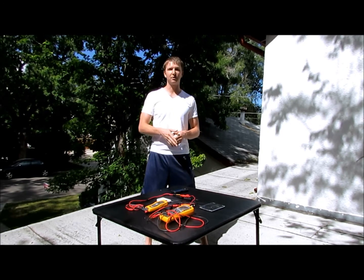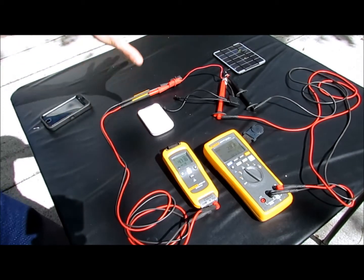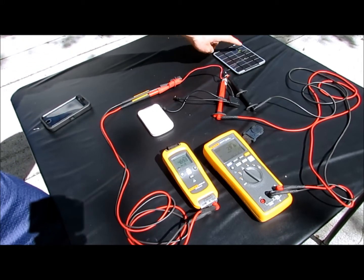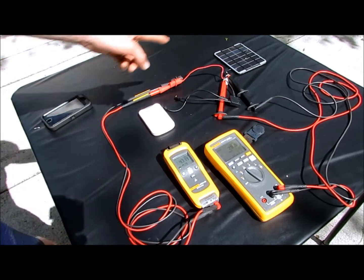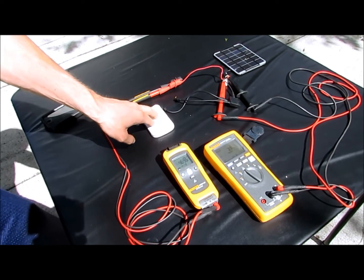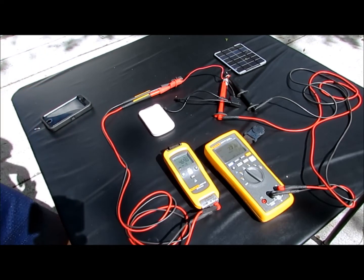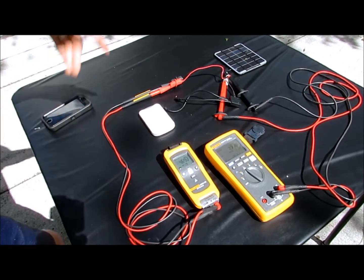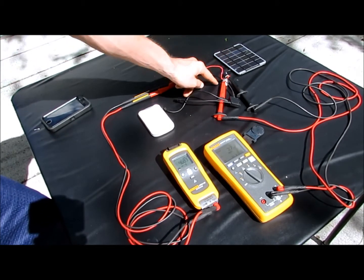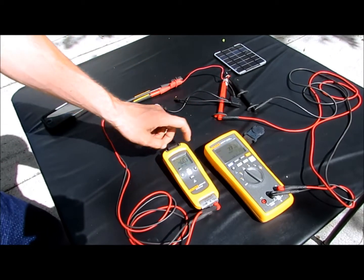Let's take a closer look at the setup and how it's going to work. This is a Voltaic Systems battery which is designed to charge from one of their solar panels — a 2 watt panel going directly into their battery. This battery is at a very low state of charge. I want to make sure it will slowly charge the battery instead of coming in full blast and damaging the lithium ion inside. The test setup is pretty straightforward: I'm monitoring voltage and current, with the current measured across a 0.1 ohm resistor using two Fluke instruments.